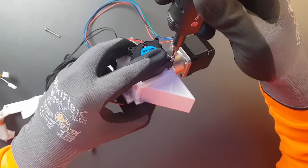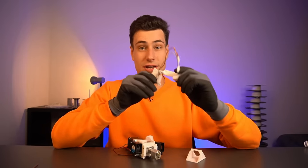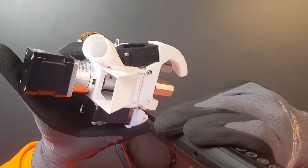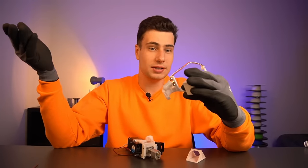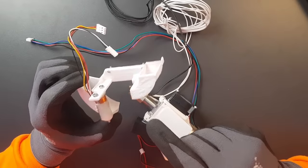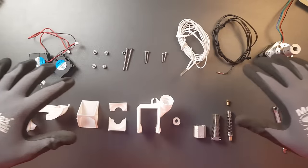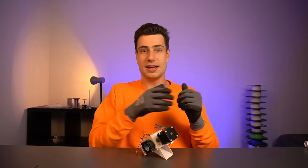Let's finish the assembly by adding two cooling fans. The last 3D printed part is the fan duct, which screws to the housing with two screws but also allows you to mount a leveling sensor like a BL Touch. Some pellet extruders have hardware like motors or multiple heating elements that make them impossible to connect to your printer. For this reason, the Green Boy pellet extruder uses only motors, heaters, sensors, and fans you already have in your 3D printer — you simply unplug them from your filament printhead and plug them into the pellet printhead.